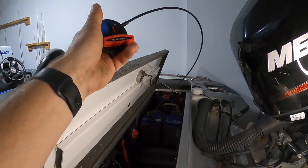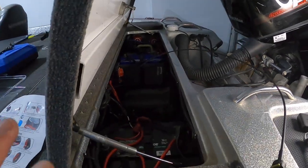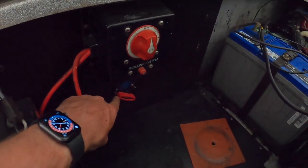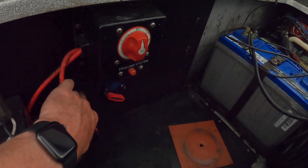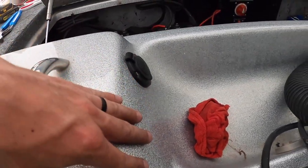I got the version with six feet of cable, so you can see this is kind of what I have left over. I'm going to do a little finagling and try to figure out exactly where I want to put it. Here is where I ended up putting my remote drain plug lever — you can see it's down here, I have plenty of room to access it, right underneath my troll motor switch. It ended up just being the easiest spot. It's a one and three-quarter inch hole with a hole saw. You can mount it in your actual fiberglass or on the side — there are a lot of options. I just did not want to put that size of hole in the transom area. It seems to function well and I'll put it to the test on the water — should make my life a lot easier with the boat on a lift. Thanks for watching guys, hope this video helped you.